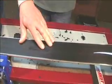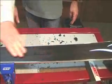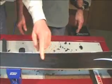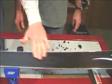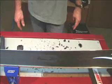At some point, run it through a stone grinder. Correct. And resurface the base, where at that time it'll clean this up substantially and get it perfectly flat with the rest of the base.